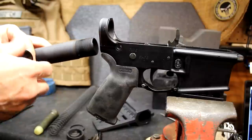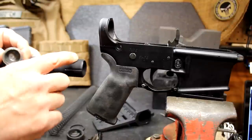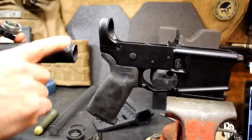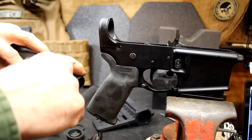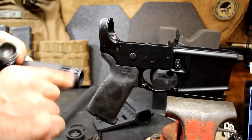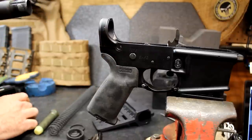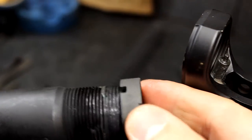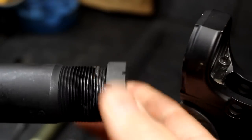Now on the threads of the buffer tube, we're going to put some of this AeroShell 33 lithium grease. And it really helps with the threads. Even though they're both aluminum, they're different properties, and you need to have those threads dressed. I'll have a link below where I get this. I get this from a guy on eBay. I like these little vials. Now take your castle nut with the teeth facing outward and just go ahead and put it onto the buffer tube. You want to screw it on pretty good.